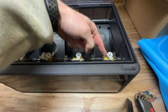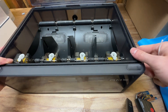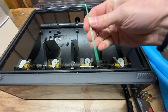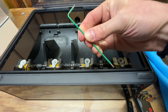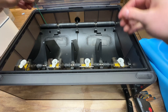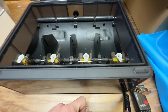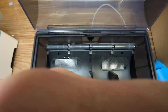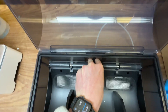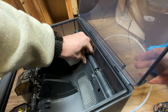This led me to believe there's filament stuck between the infeed and the exit position of the AMS. To pull this apart, use a two millimeter Allen wrench. I've already loosened these two bolts — loosen them all the way off, and then the last thing is to pop out the feed tube at the back.